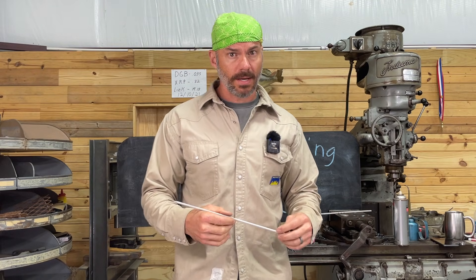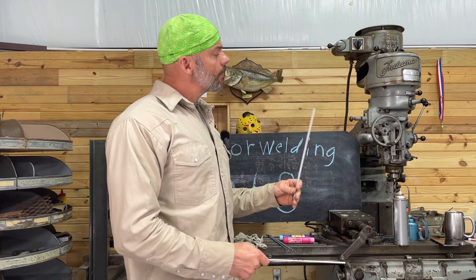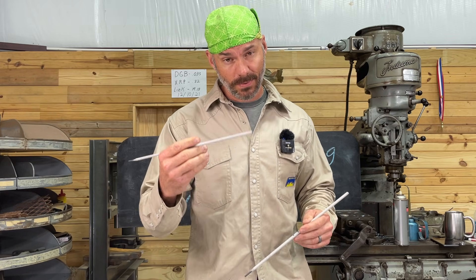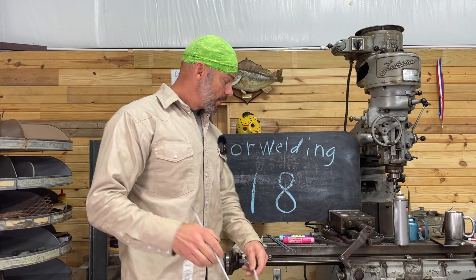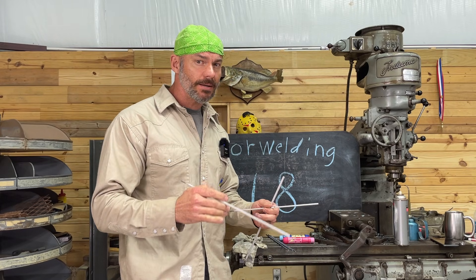You're going to have to listen to this video a few times if you're really interested in learning how to do 7018. The 5/32 going uphill — I know some welders that can do it. If you've got a big bevel, I could see it. I saw a guy do a two-inch heavy wall test with one of these — I never thought I'd see anybody do that. It's hard and it doesn't look near as good as a 1/8, and it looks even better with a 3/32. But just know you're giving up time using these little rods, so try to always lean towards that bigger rod. It'll save you time. People are a lot happier when you get 8, 10, 12 welds a day instead of two or three.